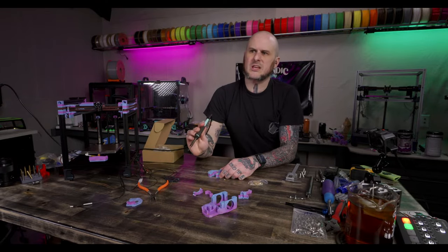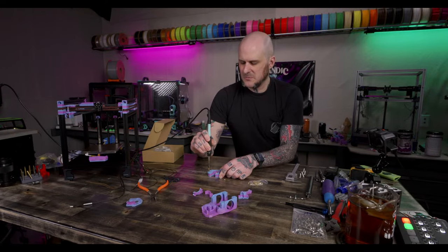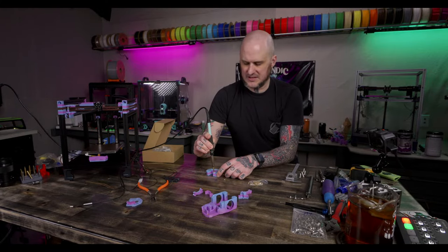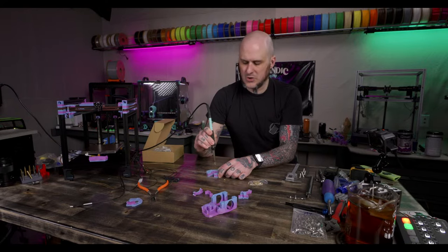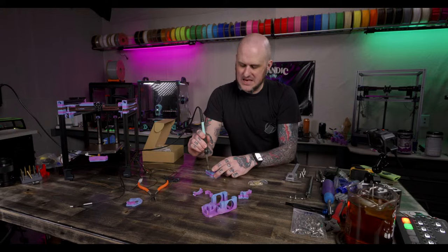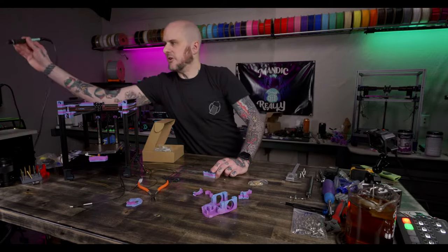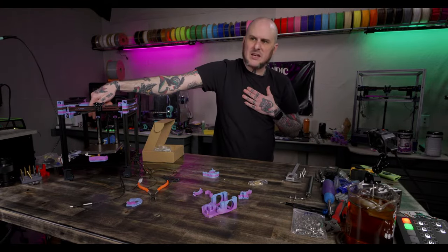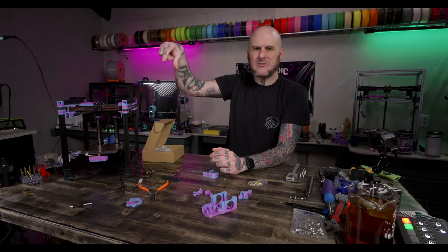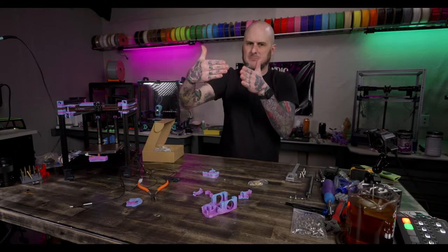Have you looked at Zero Filter? Thinking about using it instead of Nevermore. The one thing I like about Zero Filter is it would allow for dual auxiliary fans, so you could run the Zero Filter and still run auxiliary fans on both sides of the chamber. I like that. Problem for me is my hex panel. This is dumb reasoning, but it's a reason. The Zero Filter mounts at the back of the chamber, which even with the auxiliary part fan might be rather difficult to reach, because of how much the auxiliary fan's gonna stick out. I think it might be an interference issue there. I haven't mocked it up together.